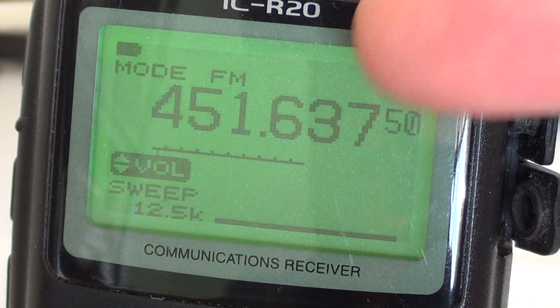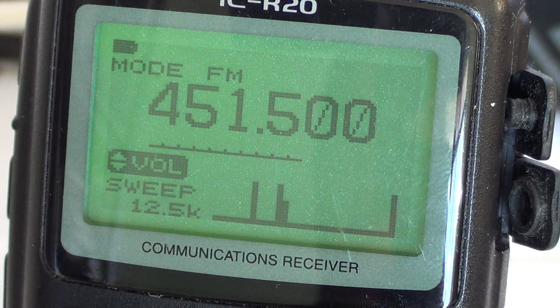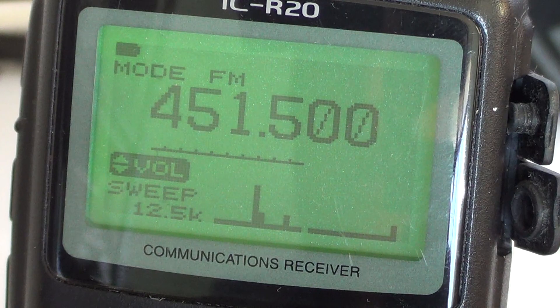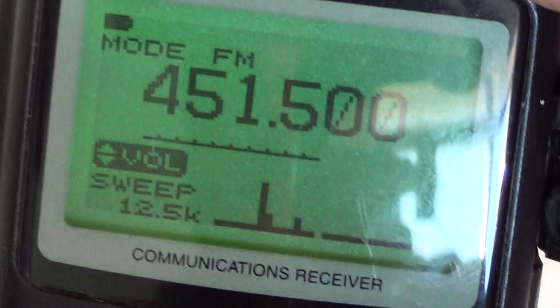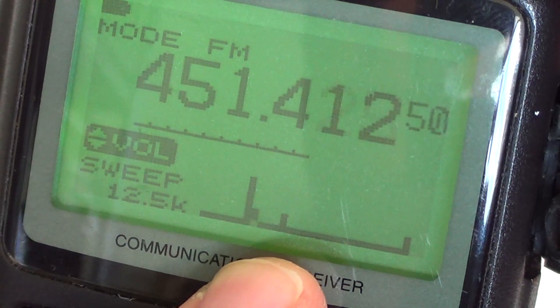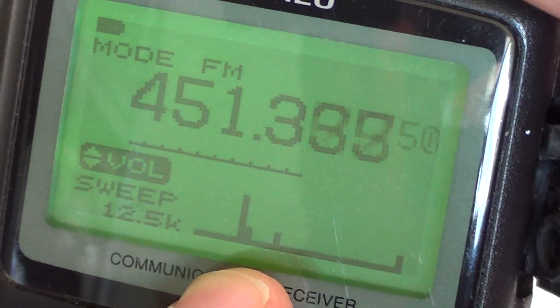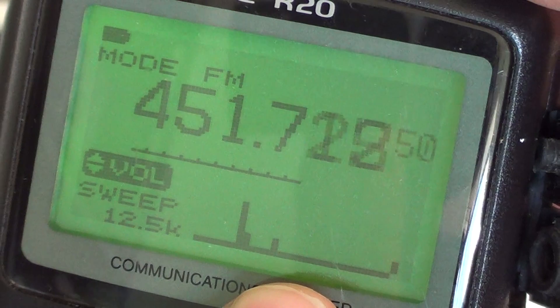You can actually change the frequency while it's scanning — so you see some spikes appearing. To identify what those signals are, just press the scope key to stop, then use the right dial button to change frequency. You'll see your little white dot on the display, and tuning to the big spike reveals another digital signal. It's a very nice feature for knowing what's around to listen to.